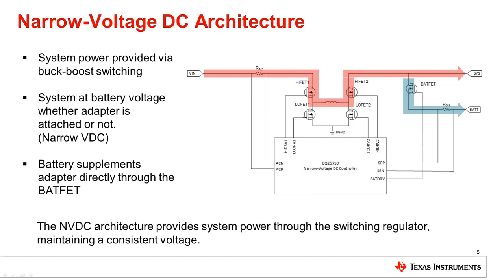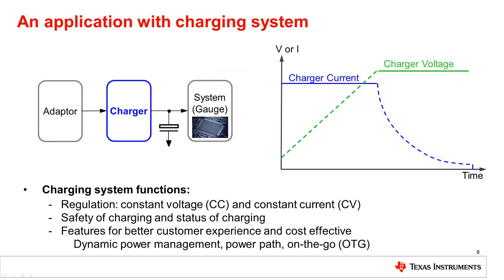The trade-off is that while the BQ25710 is highly efficient, there is still some small switching loss between the adapter and the system. Now let's take a closer look at what it takes to charge a battery. Most battery chemistries use a combination of constant current and constant voltage charging. Here we show a common charging profile for a lithium-ion battery: when the battery is deeply discharged, constant current charging is used at a rate specified by the battery manufacturer, and as the battery approaches its maximum charge level, the charger transitions to constant voltage charging for a gradual approach. Both the BQ24800 and the BQ25710 have CC and CV charging modes and automatically transition between them at the appropriate time.